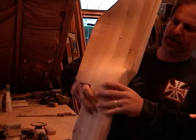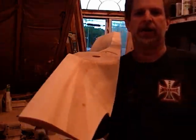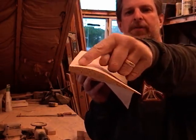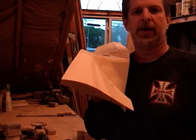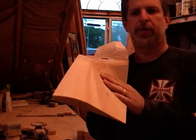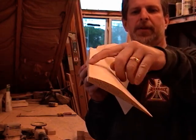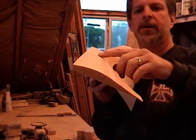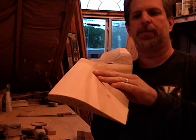I've done that on the other side. The top profile is now created. It's a little roughed in but when I get it glassed out it'll look great. I always start with this top front edge here — I'll put a profile on it, get it nice and smooth. Then I'll put the front top leading edge and then a really small fillet. In this case this prop will have about a two inch radius at this point.